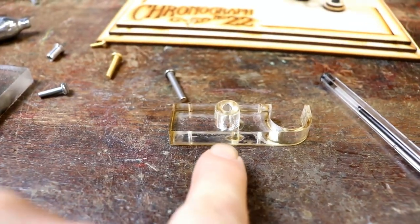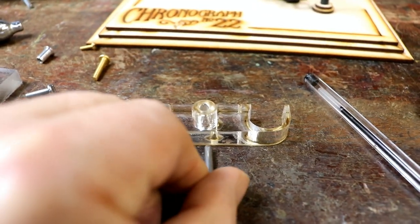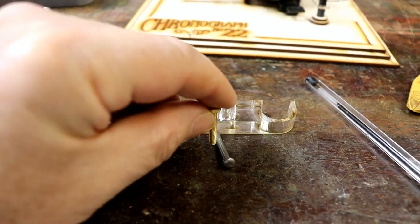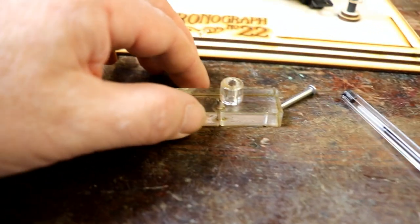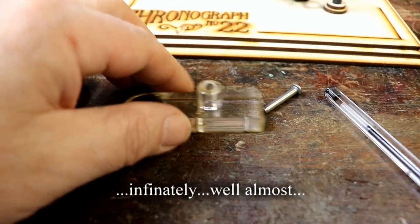by this hole that the rivet fits into, I tap it to M4, and then that will give you the opportunity to have a nice brass screw, another brass screw, that you can tighten down. That means that you'll be able to adjust the distance of the rivet in and out indefinitely, as many times as you want.